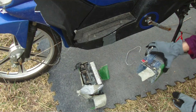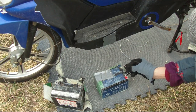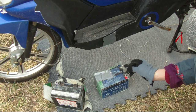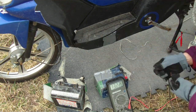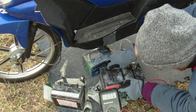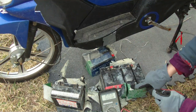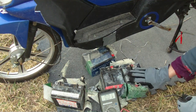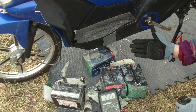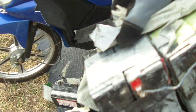This one looks like an original. You can see how they soldered it really bad. Well, this battery is completely finished. I started charging it — it's at 13.2 volts, so that battery is pretty well fully charged, but I don't know how much current it's going to have. That one only has 6 volts. So this battery actually has about 13 volts. These two batteries could be good, but this one here is dead and this one is all swelled.